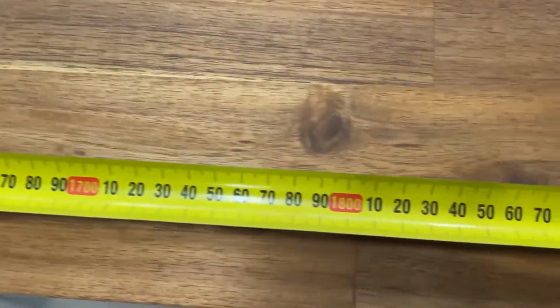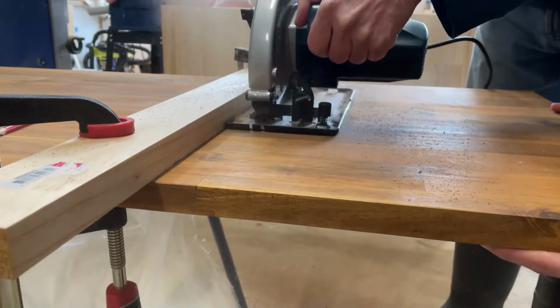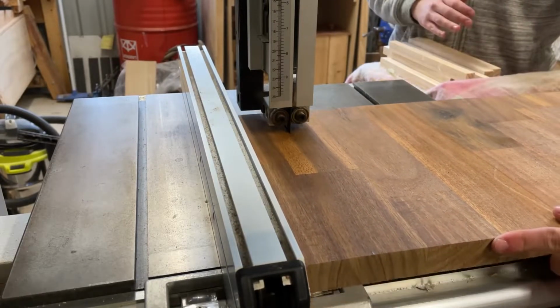We got the snazzy tape measure out to measure out 1.8 metres long, which is about 6 foot if you use those dumb imperial measurements. Then we can kindly borrow Dad's 20-year-old circular saw to cut off the excess. We are left with about 400mm left over and we need to chop about 30mm off the end because this is where the computer will sit.